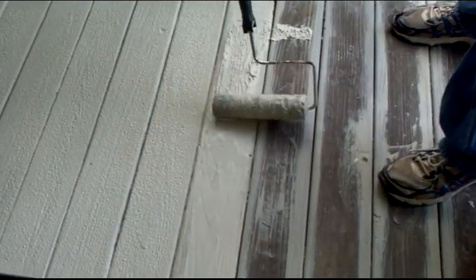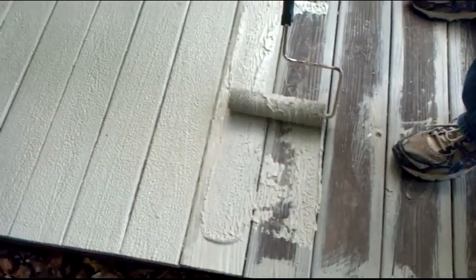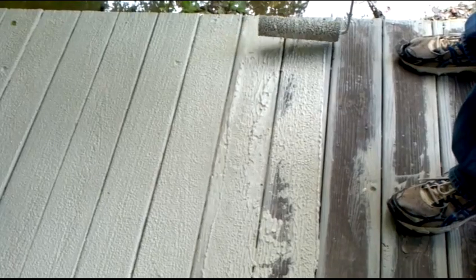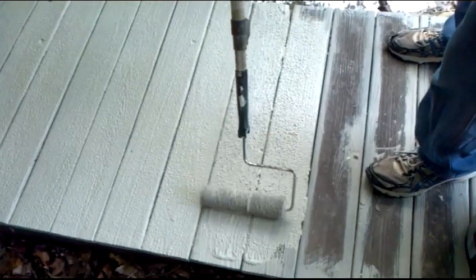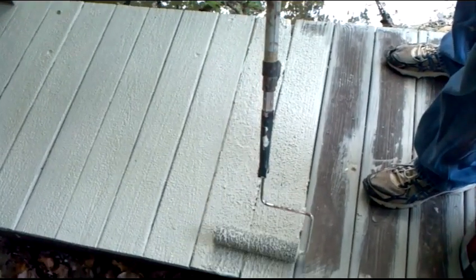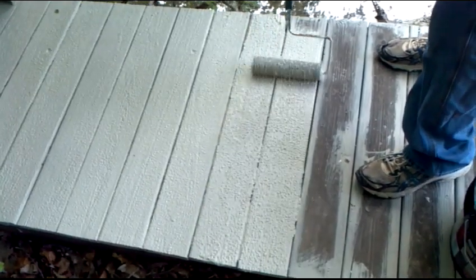That's found to be most effective. Roll with pressure on the right side to clear that part of the roller, then come back the other direction with the left side, trying to keep it away from the edges, and smooth it all out. This is the first coat — the slower you go, the less stipple there is.